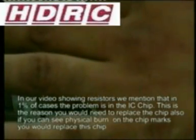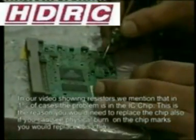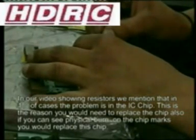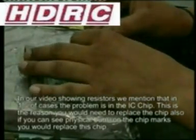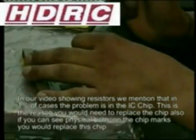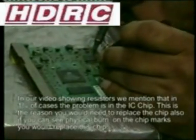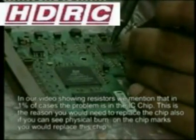When you're ready to solder or resolder the IC pin back into place, you can align it using one of two methods. The first is that there will be physical markings either painted on or printed on the circuit board and the chip — in this case indicated by a circle and a double mark. Some chips, as an alternative for pin one, will have a dimple, a small dot, or the edge may be beveled.